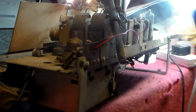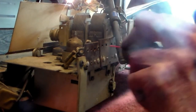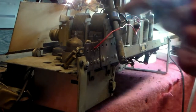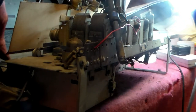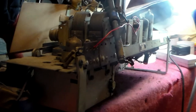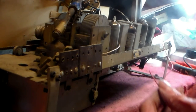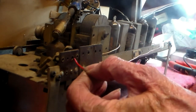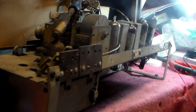And there's VHF or FM on these sets, so it goes up to 101 megahertz on FM. But as you can hear, it's working. VHF FM does have an aerial, this here. There's one in the set as well, and it's just there. But for now, it's some piece of wiring like that. Right, with the aerial disconnected from FM or VHF, of course, it won't get anything, but plug it in. There we are. But with it out, I'm going to quickly take you through the way this set operates.